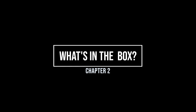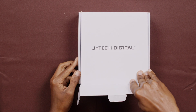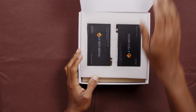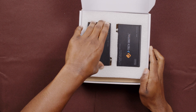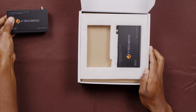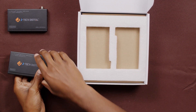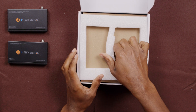With these extenders you can use Cat5e or Cat6 ethernet cable, with Cat6 being preferred for best quality. This is our 1080p HDMI extender over Ethernet — the JTech HDT 150. This is the transmitter, this is the receiver. This unit will transmit a 1080p signal up to 500 feet.